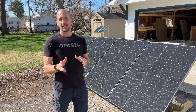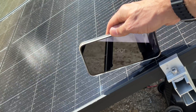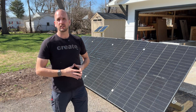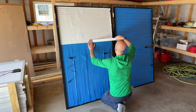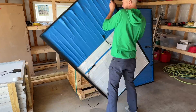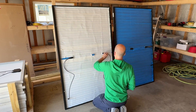I looked to remedy that and also test out a ground mount system. Instead of 10 degrees, we're at 36 degrees at our mounting location, facing due south — just like we were on that flat white membrane roof. And to make sure no light was going through the blue masking tape, I put another round of white duct tape on the back to completely knock out any light passing through the two panels that are supposed to not have the bifacial feature.